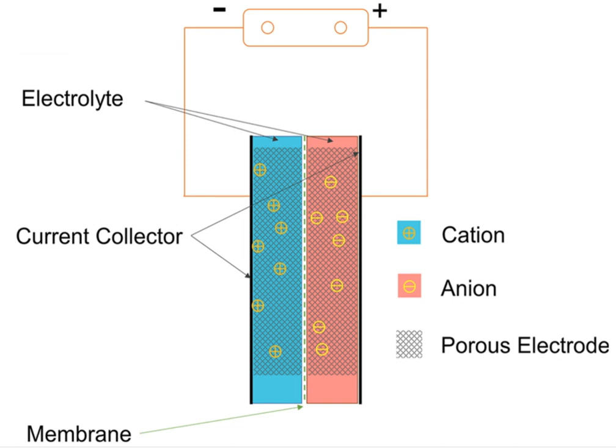The presence of the supercapacitor electrode alters the chemistry of the battery and affords it significant protection from sulfation in high-rate partial state of charge use, which is the typical failure mode of valve-regulated lead-acid cells used this way. The resulting cell performs with characteristics beyond either a lead-acid cell or a supercapacitor, with charge and discharge rates, cycle life, efficiency and performance all enhanced.